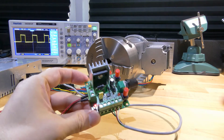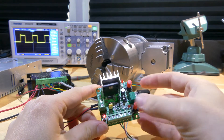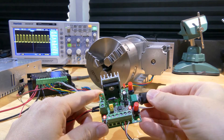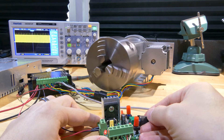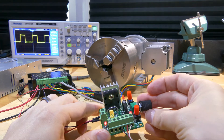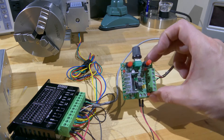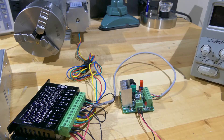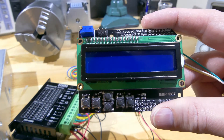What I want to show you here is what the stepper controller does — it's basically just a pulse output module. At its slowest setting, the frequency ranges from 90 hertz all the way up to 2800 hertz. Haslip Cycle Works wants to add some features like having it move slower and adding a pause, so I'm going to use the Arduino Uno in place of the stepper controller. I'm also going to use the keypad shield with LCD for user input and display.